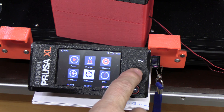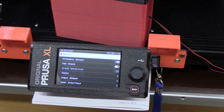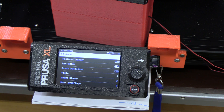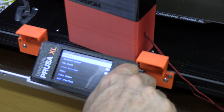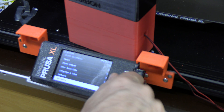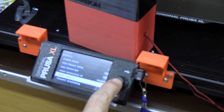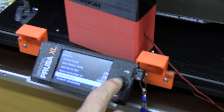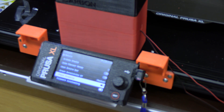When you go to Settings, you'll see that crash detection has been turned off, because resonance dampening and crash detection cannot be on at the same time right now. We want the resonance dampening, and they're working on allowing both to work together, but it's not there yet. To turn the dampening on and off, go to Settings > Hardware, and Phase Stepping is where you toggle it. We're going to leave it on, but during a print we'll turn it on and off to check the sound levels.